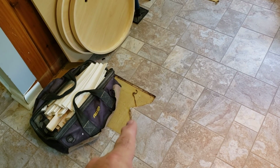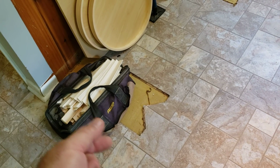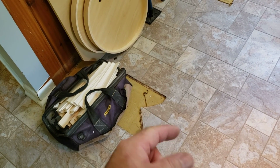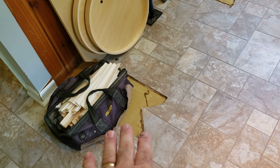That's going to take a 642 filler to do that. And then we're going to put OG pilaster molding down the side of that cabinet and across the front. And that'll give that a fully flushed out front on the actual front of the toe kick.